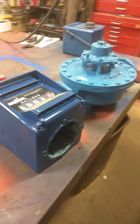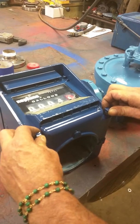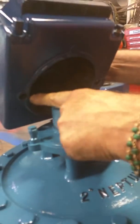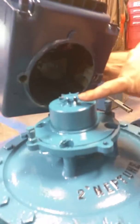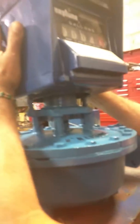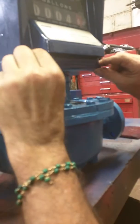He's going to talk through how this register goes on. There are two bolts in the register head that do not come out — they're loose. Take your register head and line up these two holes for those two pins. You want to be gentle when you set it down, because this star gear has to line up with this fork. Set it down gently and then tighten these two firmly — don't over-tighten it, just firm is good.